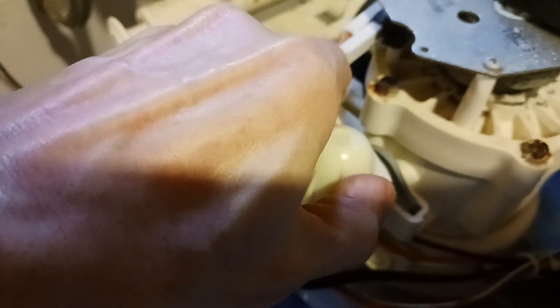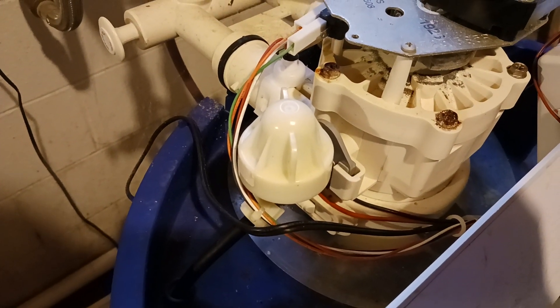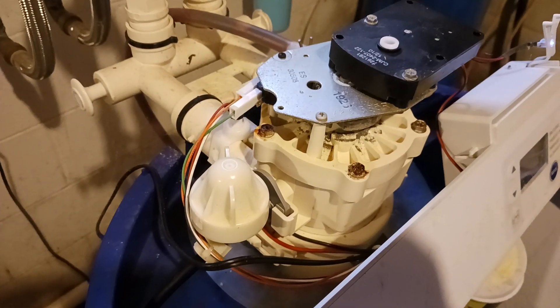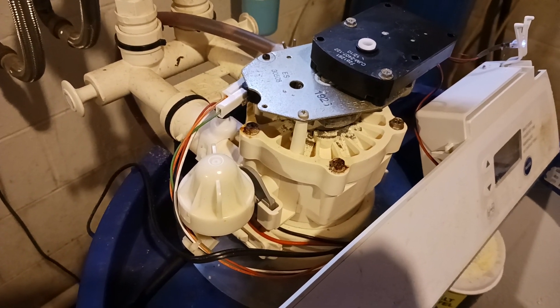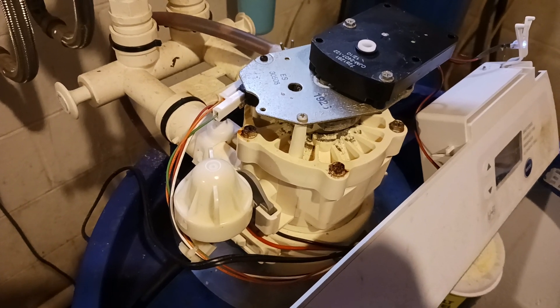Just take the lid right here, tighten that back down on top of it. So we've now replaced the cap and the orifice valve is all clean. We'll turn the water softener back on here and hopefully we will not have orange water or orange stains anymore now that that's cleaned out. Thanks for watching.